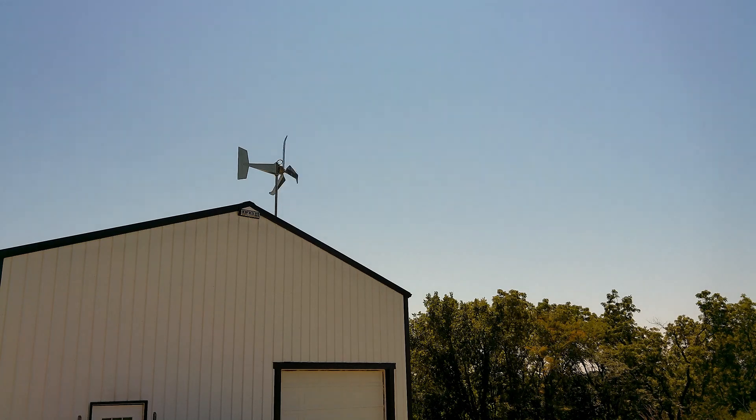I had the tail fin all put together, then I put the blades together on the hub and hauled everything up there individually. I set the power unit on the pole — that's a two inch galvanized schedule 40 pipe, that's what you'll need to mount it. I mounted the power head on there, bolted the tail fin on, and then ran the cable.